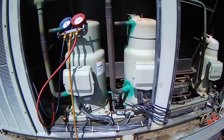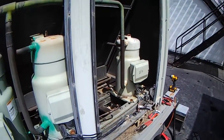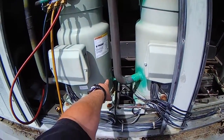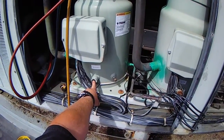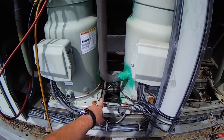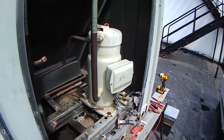In this case here, we have several compressors in the circuit and they all have a common oil. Here's your sight glass for the oil, and this oil port is connected into this one. This one's connected in the front of that one, and that one's connected in the front of this one.